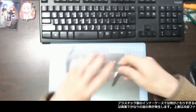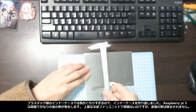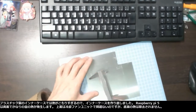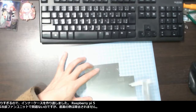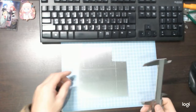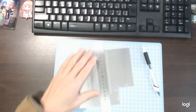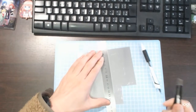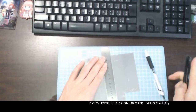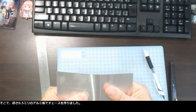Next I made another inner case, because the plastic inner case holds the heat too much. The Raspberry Pi 5 generates quite a large amount of heat on both sides. The top side is fine with the cooling fan unit, but the heat on the bottom side stays there. So I made an aluminum chassis with a plate of 0.5 mm thickness.